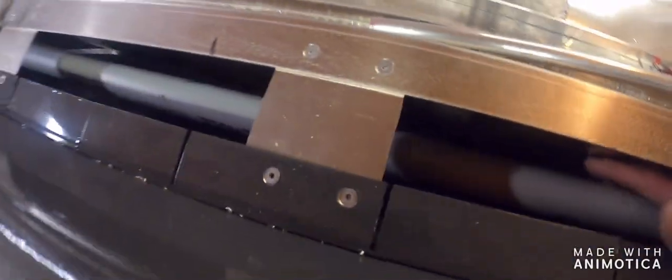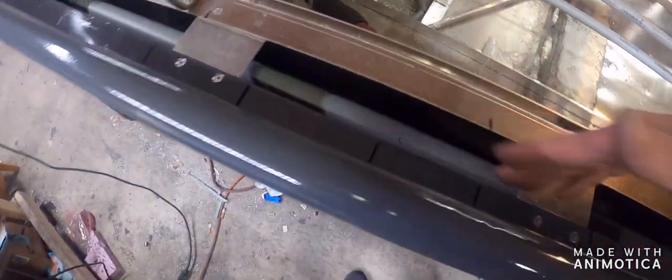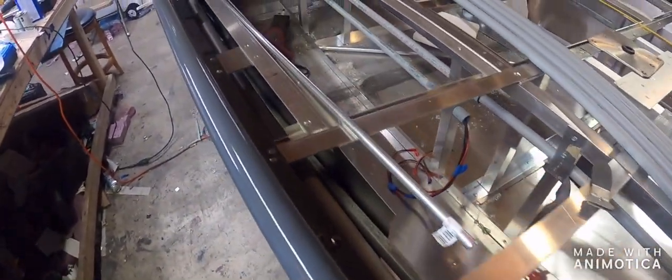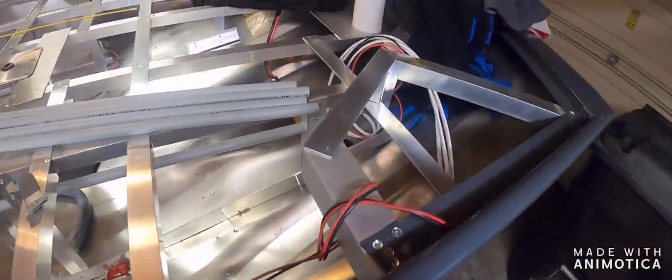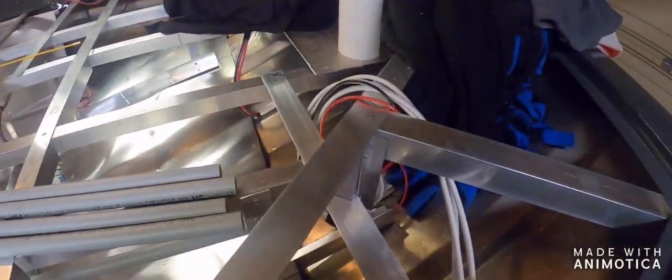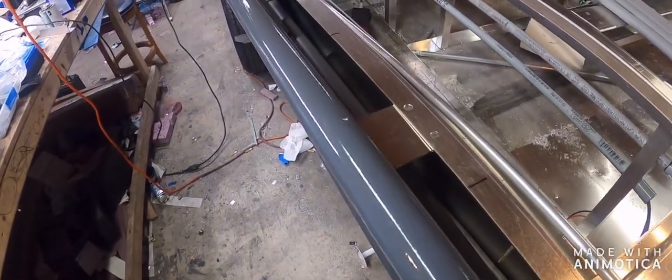You know, I'll have to wiggle my conduit around, but you fill all that in, that's a 4-inch wide cavity that goes down to nothing over 18 inches. That's a ton of foam. Fill it all in once your wiring's done. You can see all the conduits I ran. I have wires coming out everywhere. So try to account for everything that you need, because once you foam it, you're not getting back in there.